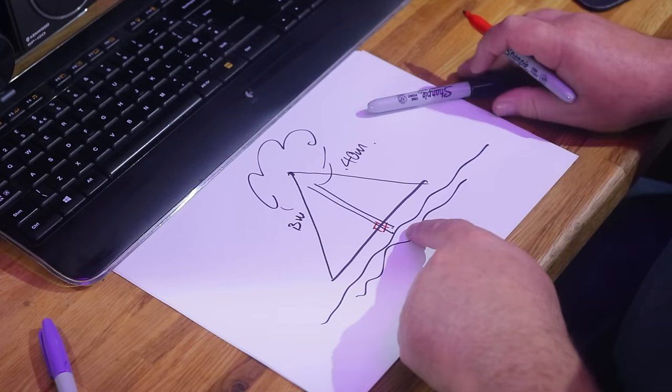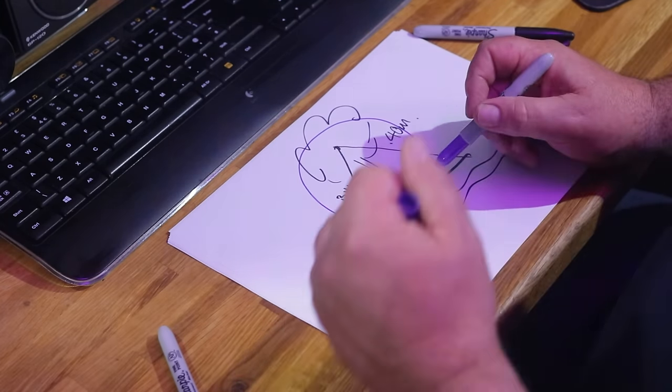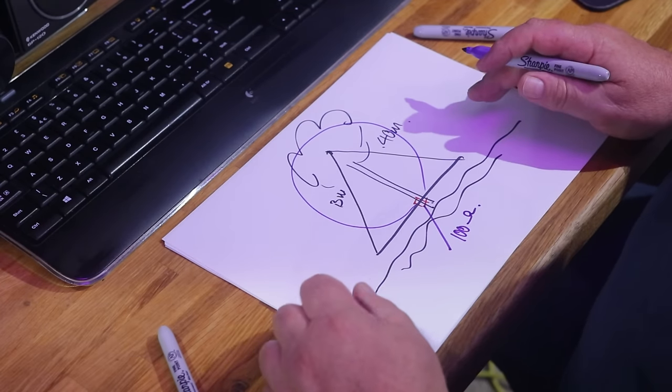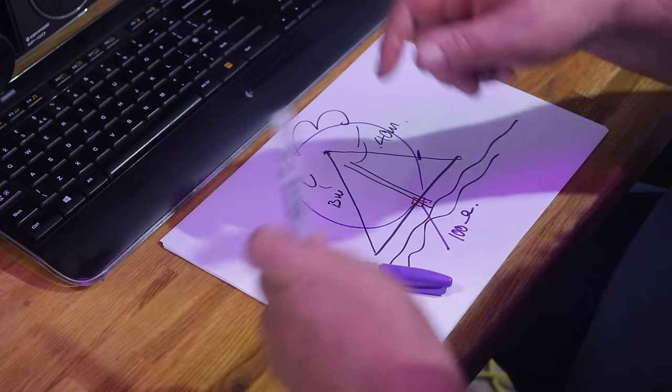The first option is to get your coax and go right in the center at the bottom. What happens then is it looks like a cloud-warmer — you end up with a nice big bubble of RF, so people 500 miles away can hear you. It receives nicely too. It's a very pleasant antenna. Now the feed point impedance there is about 100 ohms. What I do know is that if you're going to this trouble, you probably want to feed it at a quarter of a wavelength down from the top instead.